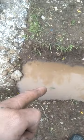I need to move that a little bit, create a drain. Because if I let that go and I build on that, that's gonna rot my wall like real quick. So I need to make sure it's all draining first, then I can finish off my foundation. It's not a step back, it's a step forward.